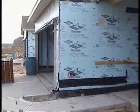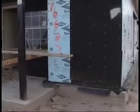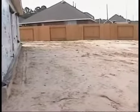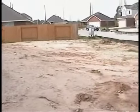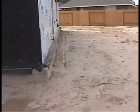This house today, we're looking inside, doing a framing inspection, as well as some other items. As we first approach the house, you want to walk around and look at the drainage. Now, the code requires a positive slope away from the house, what's called 6 and 10 feet, which means that in the first 10 feet away from the house, the elevation must drop 6 inches to allow for proper draining. This prevents water ponding, which of course can lead to foundation problems.